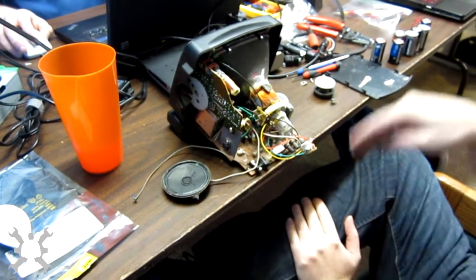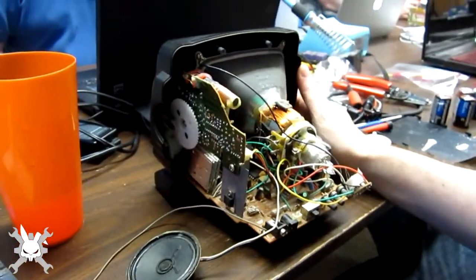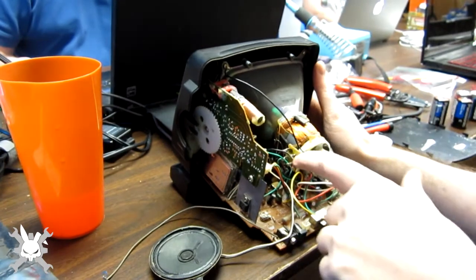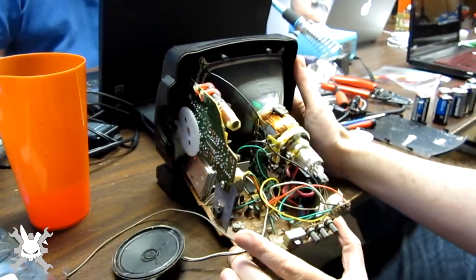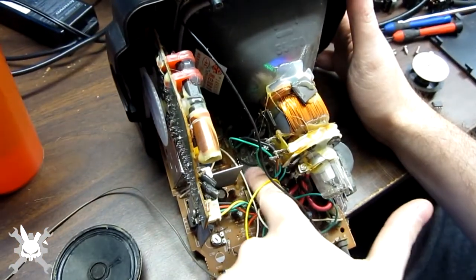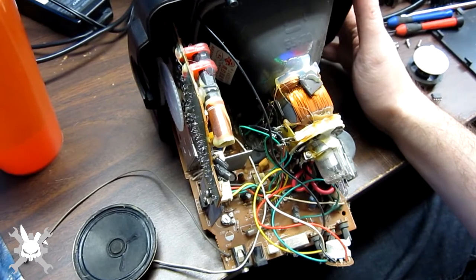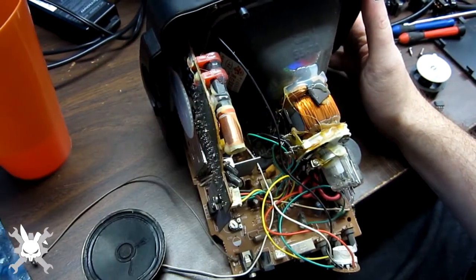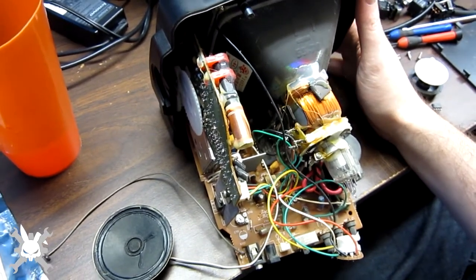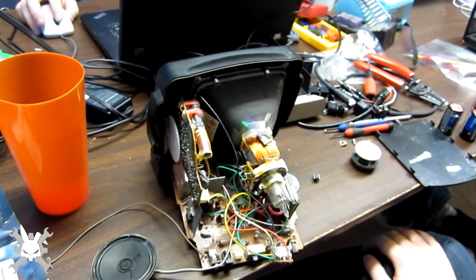Last week was the gift exchange, and I managed to score this old TV, but it only has an external antenna input, and that's pretty useless nowadays. So we're going to try to modify it for composite input. So we looked at the chip that's up inside of here, and Peter's found a way to actually tap into the video output of this chip, so that we can feed composite in instead of broadcast television, which doesn't exist anymore. And we're gonna need to invert the signal before it goes there though. So we're looking into an op amp and some resistors and getting power to it and stuff like that.